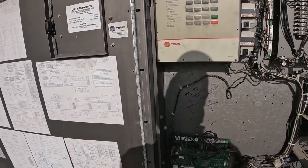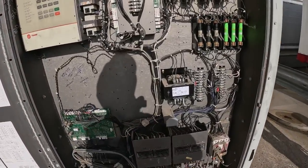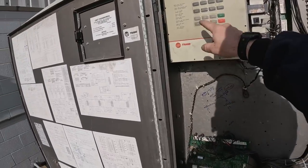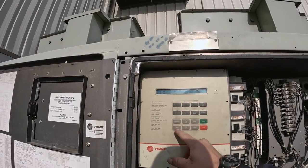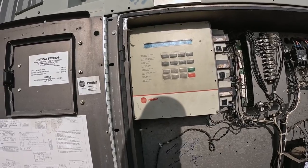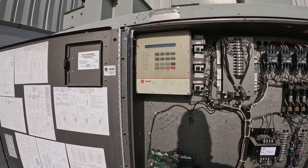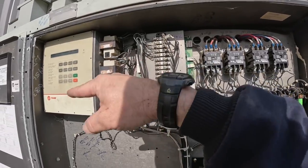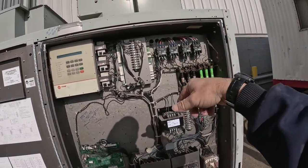See, right now it thinks it's running circuit one but it's really running circuit two — so one and two are swapped. It doesn't know the difference, but all the protection circuitry is still in there. Once it hits about 80 degrees, I noticed that's when it's bringing on the condenser fans. You come in here to status: set point 65 degrees, entering 79, leaving 77 and dropping. K11 is on, K12 locked out by the hot start — which doesn't matter because it ain't gonna run anyway. K3 is enabled and K4 is locked out. Saturated condensing temperatures 92 degrees. We also had to switch the solenoids here — those obviously have to open — but that was done by the maintenance guys already once before.